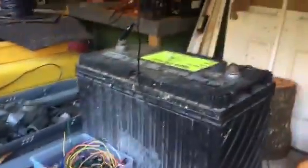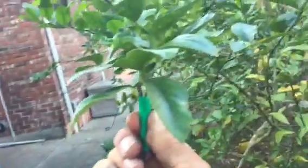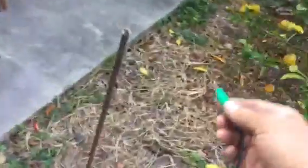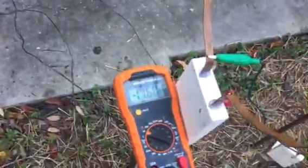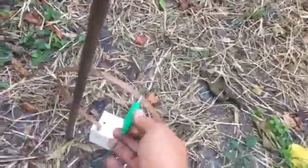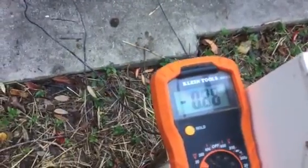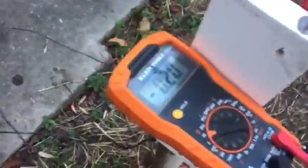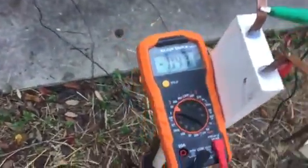Transistor — not hot at all, not even warm. Batteries pumping. I guess I got me a good earth frequency going. That's why I had the rings — I was bouncing off one ground rod to the other and lighting up the LEDs. Right now I'm just pulling this five-point-something off the tree. We'll take it off the tree — we're at zero. Going back on to the tree — we're back to 5.11. Let's go ahead and connect it to this other ground rod — now we're up to 11.6. Let's connect it to this other ring — now we're fluctuating. The ring has got to be picking up off of this primary, which is off this ground rod down in the ground, two and a half to three feet. We've got some fluctuating going on over here.